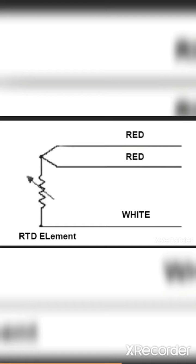If we look at the circuit diagram for a 3-wire RTD, we can see why there is a short circuit when we measure the resistance between the two red wires. The resistance changes in proportion to the temperature exposed to the tip of the probe. So if we measure between any red wire and any white wire, we measure the resistance sensed by the probe.